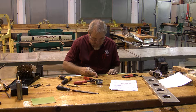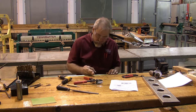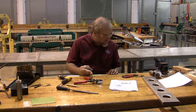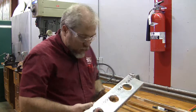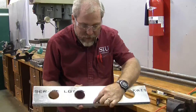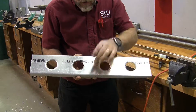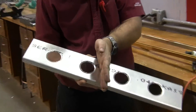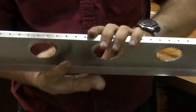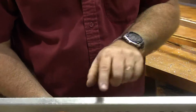They start at the very center — just like before, it's 24 inches so the center is at 12. That's my center mark and I'm going to mark out three-quarters of an inch each direction. One of the mistakes that probably happens to more people than anything else on this particular spar is that they don't line up their hole pattern on the center. If those holes don't line up, it's going to be really hard to patch them later. So when we lay out the hole pattern, it begins at the center.